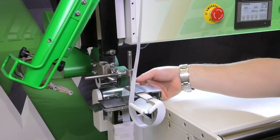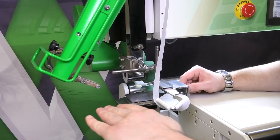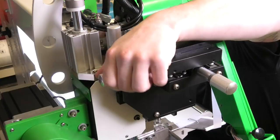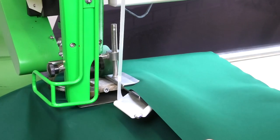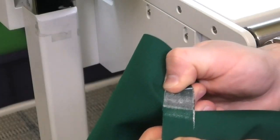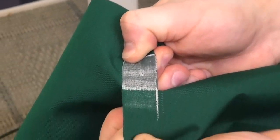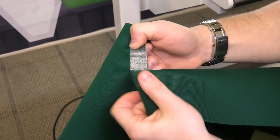What I'm going to do to make my adjustment is grab this knob and adjust that wedge in maybe a half turn or a quarter turn and just see what we get. Now we're seeing those legs again sticking from one side to another consistently all the way across that one inch seam.